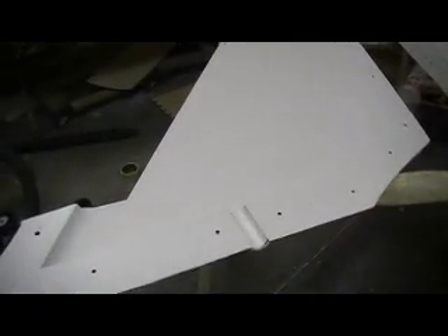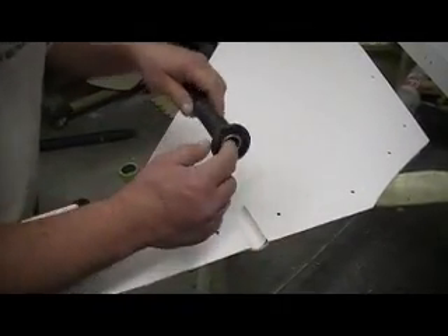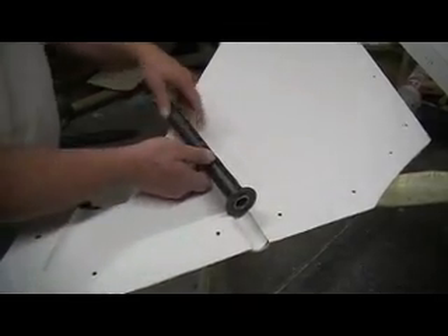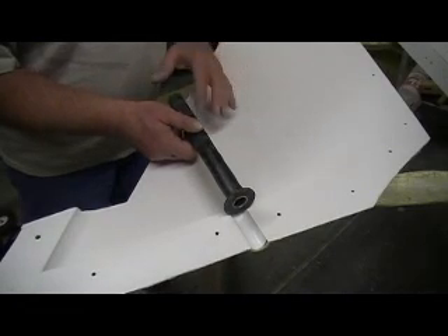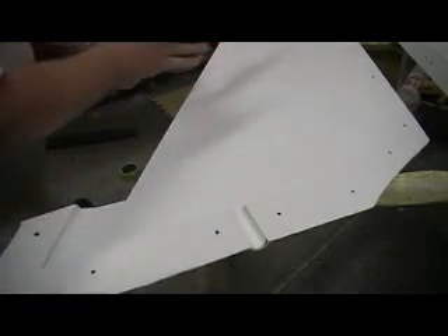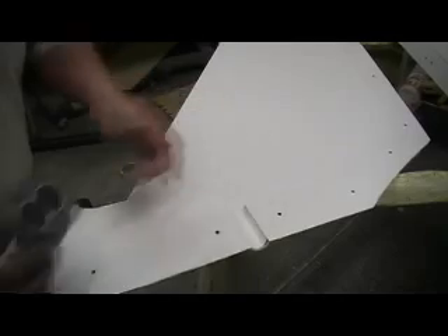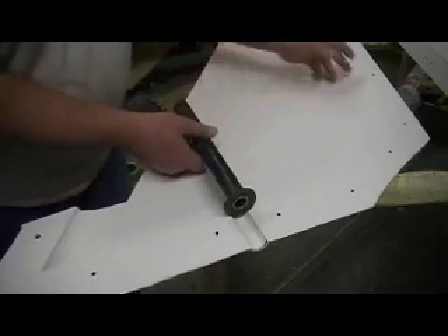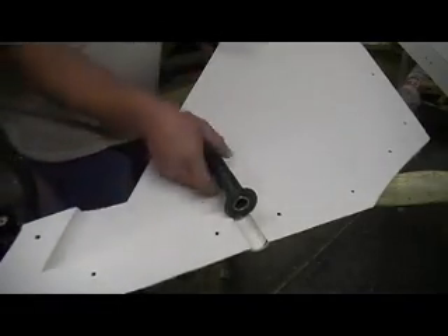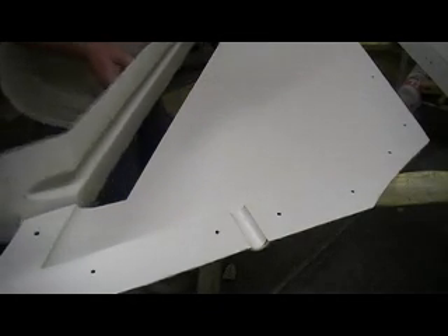When I got these apart, I got this already in there. What I'll probably end up doing is putting a slice in my mold so this will drop down in it. So I can put my structure in here with this other rib before I glue my parts together. I can lay my part up, cut that round, and slide that down in there, put my rib in, put my two halves together, and take this mold here and make my flanges.